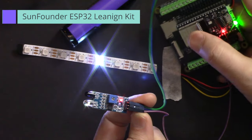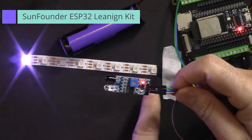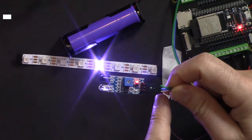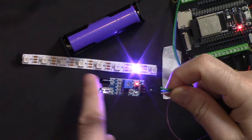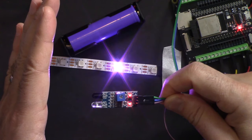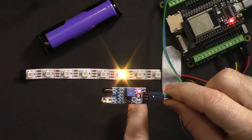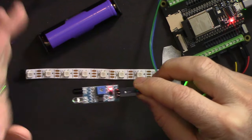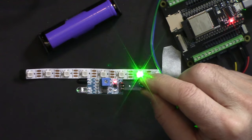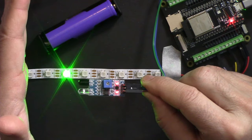In this lesson we are going to use ESP32 with ESP32 extension board from SunFounder, which powers up with a battery. We are going to use this WS2812 LED strip with obstacle avoidance. The color is moving forward, and when an obstacle is brought in front of it, the color changes direction and moves the other way with a random color. When the obstacle is removed, it goes back the other way. The color is selected randomly going forward, but when it detects an obstacle it shows green, or whatever color you want.